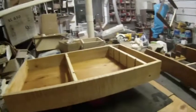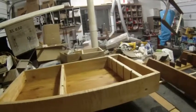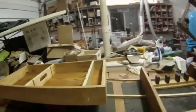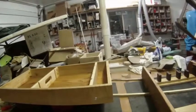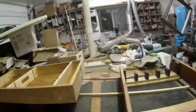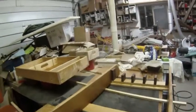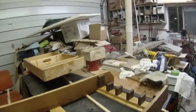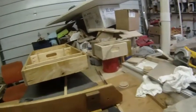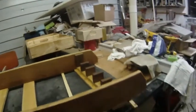I think that's just about it for this edition. It doesn't seem like six or seven hours, but it was. I have probably two more coats of the oil. The next coat will be wet sanding, just to fill in the pores and get a smoother, more glossy surface. On the end piece — which you won't see unless you're pushing the cart — it's so figured, it really absorbed the oil kind of unevenly. But I love that figure.